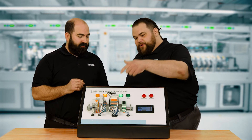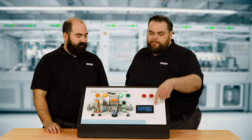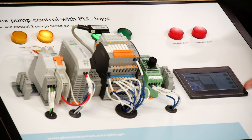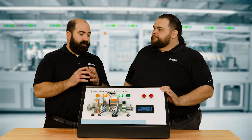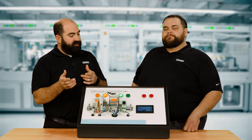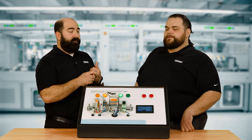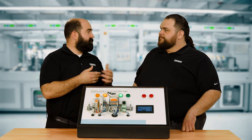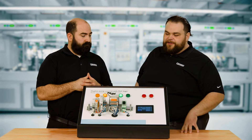The best part is we can leave it as a standalone application, or in this case we're choosing to look at that data via Modbus and can display in real time the values and output states of the logic module. So not only is it doing local control and some logic, it also has communication elements — RS-232 and RS-485. You can literally see what's happening on some sort of display, and that's what we've got here with our basic touch panel HMI.